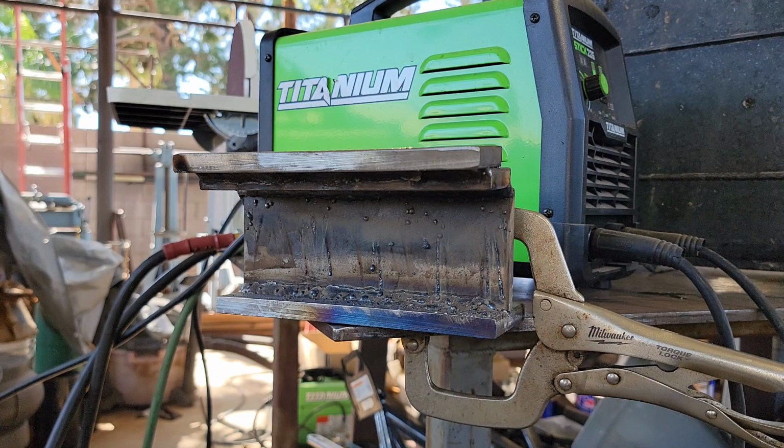There you have it. It went a little bit better. I feel like it kept stalling out because I think I had my wire speed up just a little bit too high. If I would have brought it down to like 265, I think that would have done a lot better. Anyways.